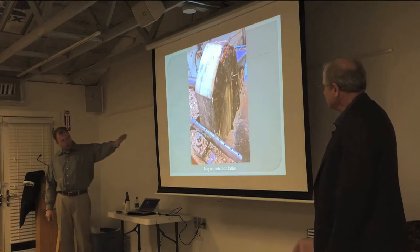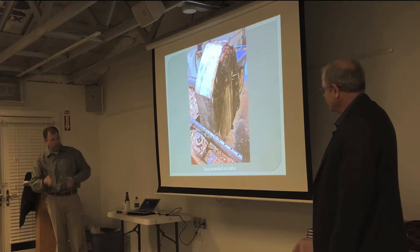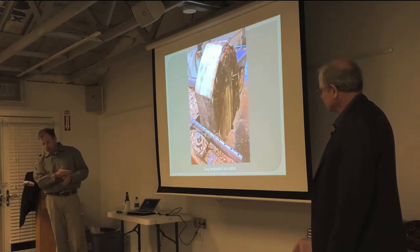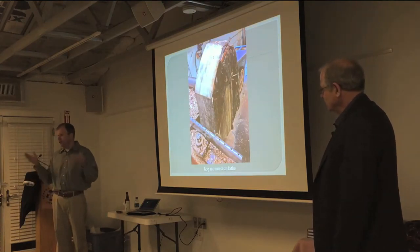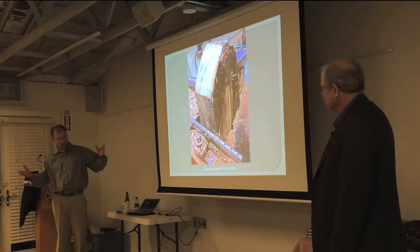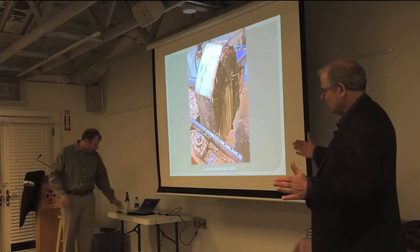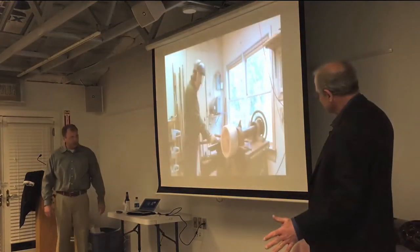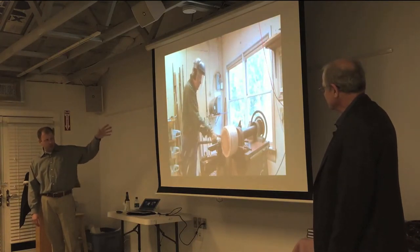And that's the tool rest we use. It's indexed, meaning that we turn off of a fulcrum and a point. In traditional turning, they actually slide the tool across the tool rest. I mentioned traditional turning, think of a baseball bat or chair leg. In artistic turning, we have an open form lathe, or an open face lathe, which enables us to create open form. We can't turn spindles or long things because there's no bed out here to hold the end of it. In this slide, my father's rough shaping a log.